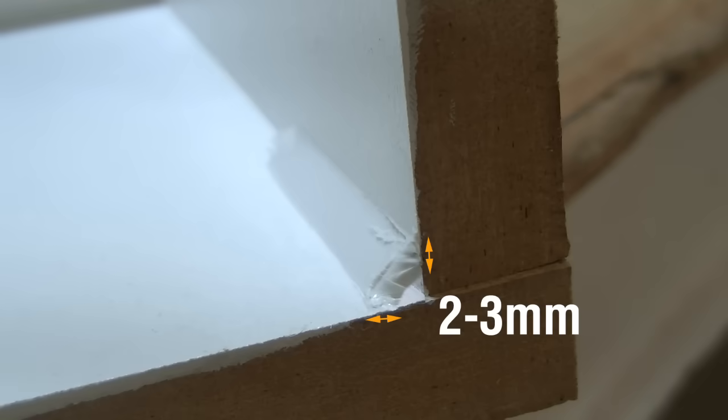Now, in terms of siliconing onto existing silicone, there's 2 points to make here. Point one, as I said in the previous section of this video, you don't actually want the silicone to knit onto all 3 corners of the joint. You only really want about 2-3 millimeters on the side and then 2 or 3 millimeters on the base. Provided your new silicone joint has that crucial 2 to 3 millimeter bond on the side and on the base of whatever you're siliconing to, if it hasn't bonded to the silicone in the middle, it's doing you a bit of a favour because it's less likely to tear should you have a bit of flexibility in your joints.